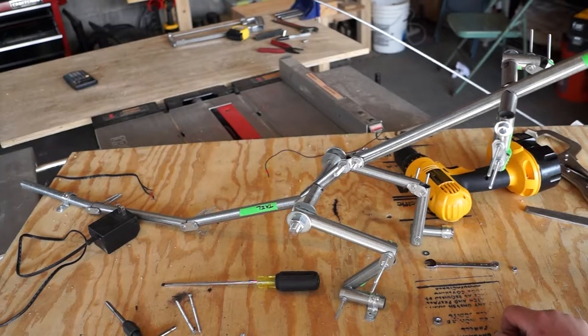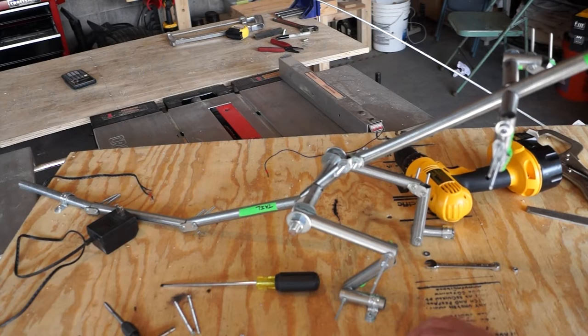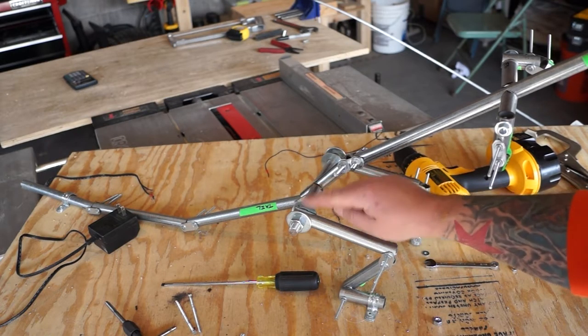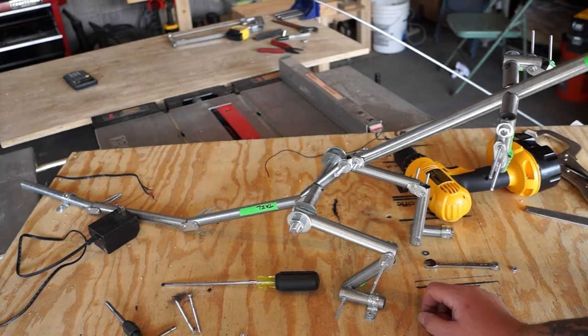So I've got my work cut out for me. I am going to be going through and remachining all of Rex's skeleton. We're going to go ahead and get Rex upgraded to a little bit better joints all the way through. Again, we're just going to continue to use our tiny aluminum plates for the time being. The only change that we're going to make between here and the next phase in our process is taking all of these joints all through the leg, all through the spine, up into the arms where I already started a little bit, and upgrading them to a 1/4-20 piece of threaded rod, and we're going to redrill all new limb pieces to function as spinal segments. So, I got some work to do.